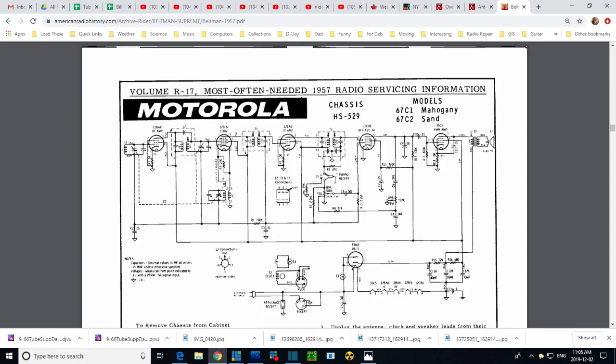This 47k resistor is the diode load resistor. Coming into the phono jack on the back — it's drawn very clearly here as a switch: when you push in the plug, it opens two contacts and replaces the input with whatever's on the plug shaft, which is the phono input. Without anything plugged in the switch is closed and the radio signal heads toward the volume control. The top of the volume control is the signal and the bottom is on B minus. It's a 500k pot, with 47k below it, so the bulk of the output signal appears across the pot, and the slider selects how much to send on. A capacitor blocks the DC.